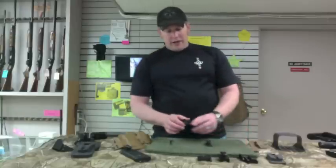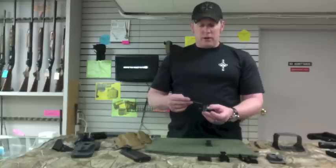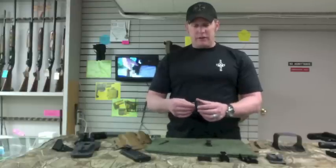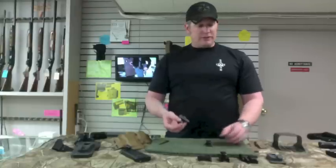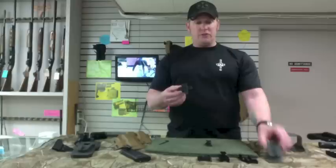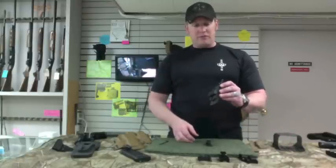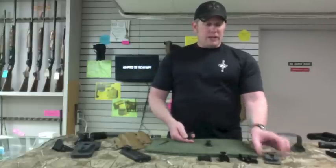Now we know the load weight on the two screws that are used on the R2S utility horizontal are at a maximum 800 pounds apiece per screw. So your load capacity on this system is significant. Your attachment system most likely will snap long before this can. Again, when we did the load test on the R2S base plate, we used this particular model. This gave us a solid platform to mount off of. We put a metal bar across this, and myself and another man were bouncing up and down on it, trying to snap the system. We didn't even get it to flex, creak, make a noise, nothing. So, we gave up at 500 pounds.